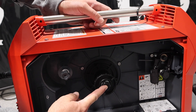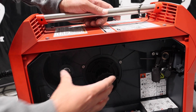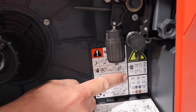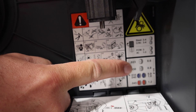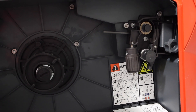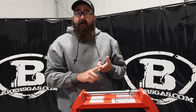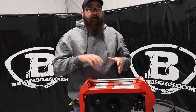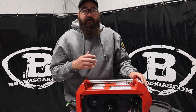We also fit a 10 or 11 pound spool on here. They have two spool spindles so you don't have to take the spool off to put on a smaller one. They color code everything — all their drive rolls are color coded. We've got 023, 030, 035, 040, and 045 — red on 045, blue on 035, white on 030. We're running a blue drive roll, so we're running 035 right now. The color code matches what the contact tip bag comes in and what the liner bag comes in. So if you've got a blue drive roll, you're going to get a bag with a blue sticker on the tip and a blue sticker on the liner box — so you can match all that up and you're not guessing.